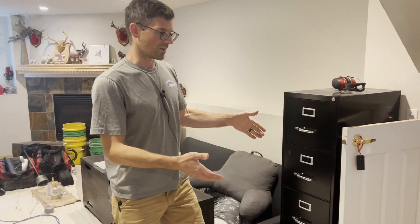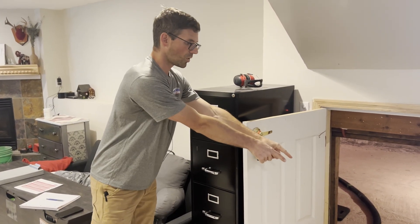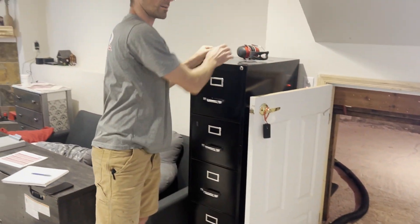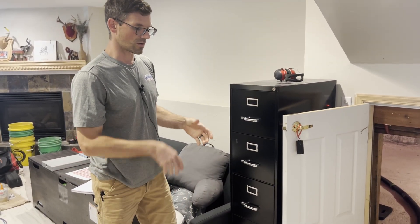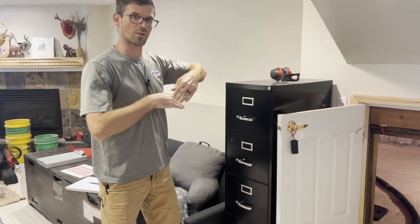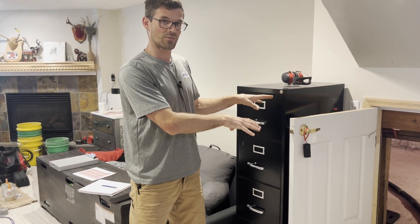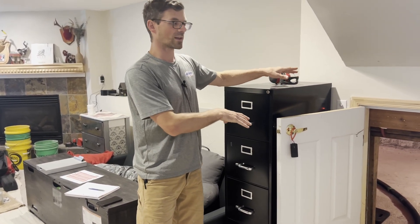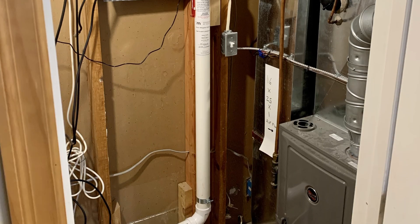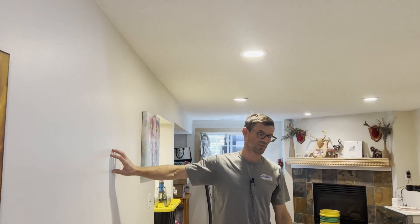One other benefit to having our suction point right here: if we need to stitch to get out here, I could pull up this corner of the carpet, pull it back, and then core a hole right under this file cabinet here, and then connect to my primary suction point by digging a tunnel under that center footing here. So this lends itself well to stitching if I need to do that. And then we're likely going to need a suction point coming up and over — there's a mechanical room over here. So this lends itself to getting pipe up and over through these floor joists and dropping into this room.